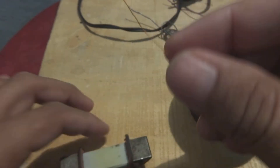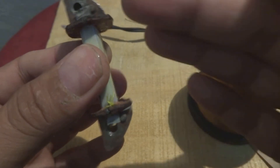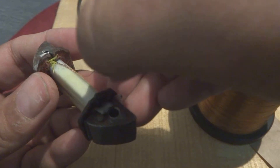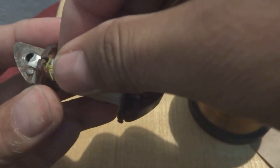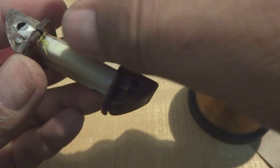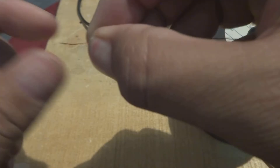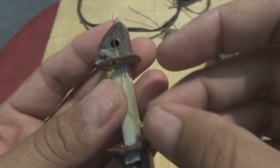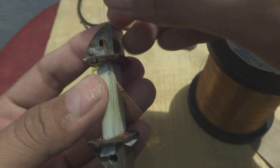So this will go in the alternator, something like this. Here we will put our ground. By this way, we have to pull this terminal through this groove slot — or whatever you can call it — the end of the winding insulation. By this way, we will just put it in, something like this, and then we will bring it out of the winding like this, and then we will start our winding.